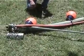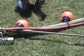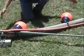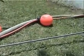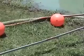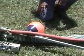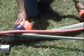And it's going to be very difficult for these shells to collect and starve our intake like they do with this head. The floats that we provide you are intended to take the payload out of the hose so that the operator with the wand in his hand is not having to work very hard. There's two small floats that you use within a short range of the suction head, and then you go to the larger floats when you get closer to the dredge. It's a matter of personal preference, and it also depends upon your dredging application as to where you place these floats. So you simply need to experiment a little bit and strategically locate these floats where they work for you the best.